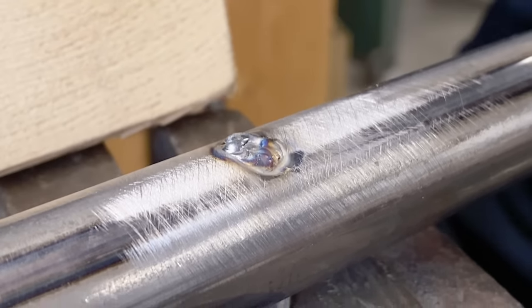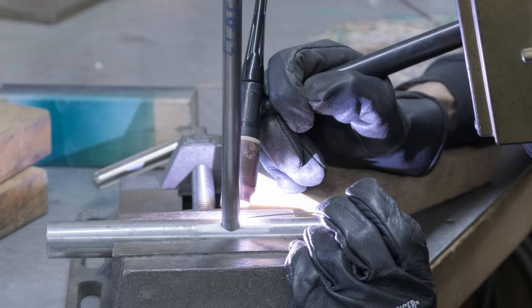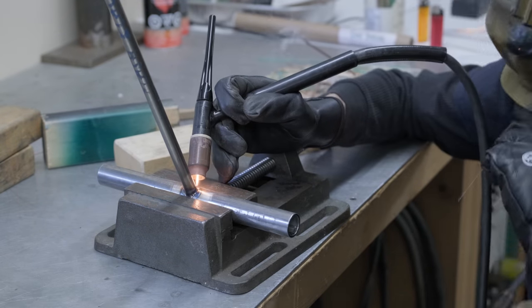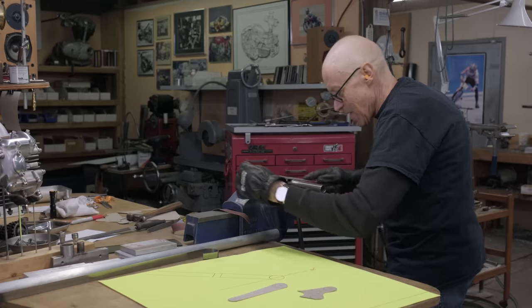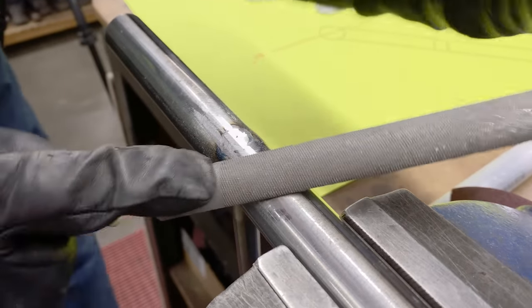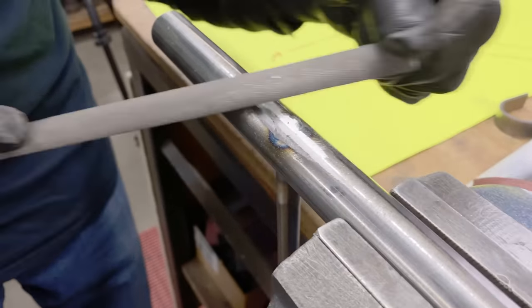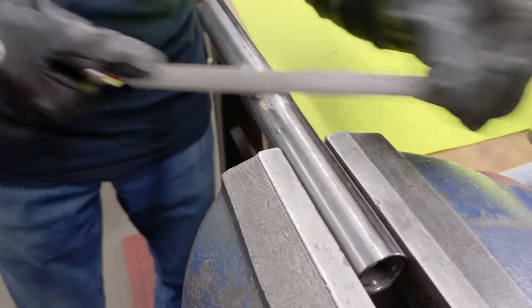It was really thin, it was burning away. I'll get a bigger rod and see if I can fill it up, then we'll just grind it down. Okay, weld it. You notice I'm filing along — the file is going forward but it's also going along. That's what helps to make it flat.